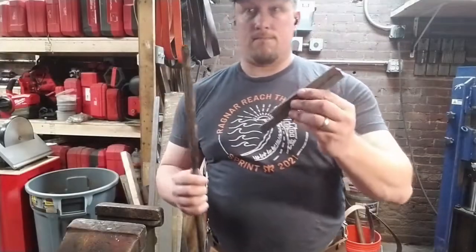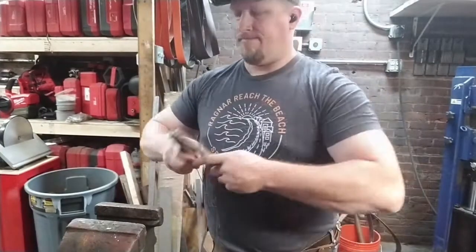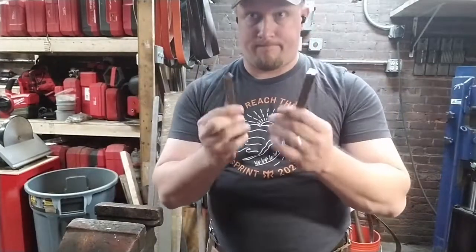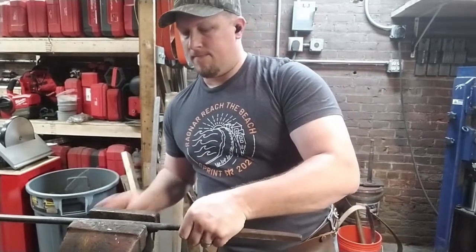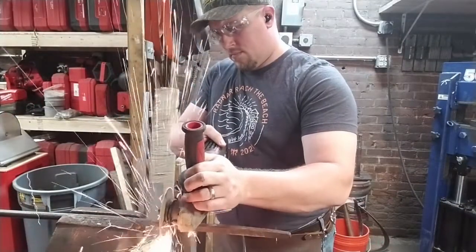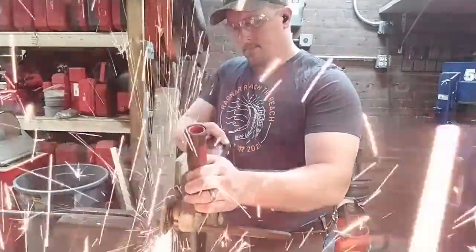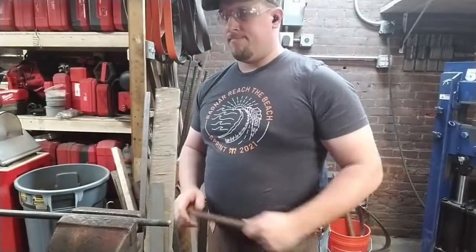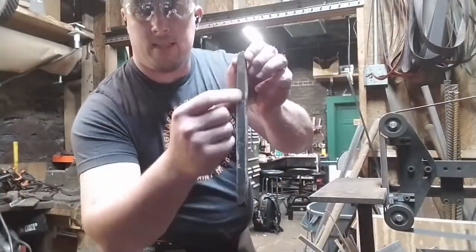Tonight we're going to weld a knife out of the steel that we had created, out of the little billets. First, we're going to break apart the fold that we had made last week. If we had proceeded straight on to welding up the billets from the bars that we made last week, that fold would have been perfect. But as it is, it's had a week to sit and oxidize, and we're going to have to improve the surface. And that's what we're going to start doing right now.